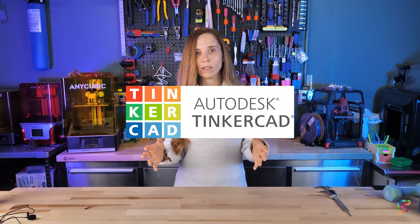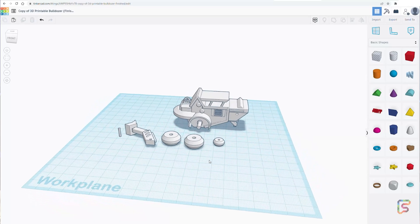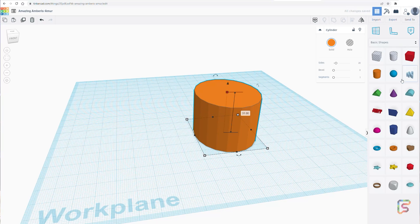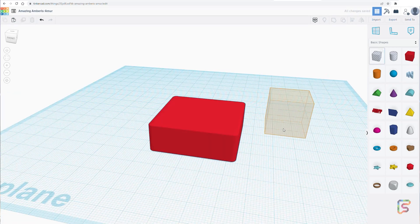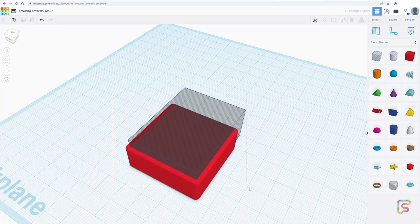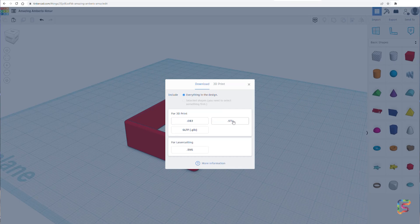Tinkercad is a product that's free, it's online, anyone can use it — even children can design in it. My son really understands it and he was 10 when he first started using it. It's all based on manipulating shapes and there's a whole library of shapes you can use to design models, and you can design fairly complicated models in there. In this case I started with a model called a rectangular prism, edited the dimensions to fit what I had here, rounded the edges off for comfort's sake, and then made a second object. Instead of being solid, it was a hole object, so when I combined the bigger and the slightly smaller shape together, I now had a C-shaped object that I could print and hook onto the table. I exported it to an STL file, loaded it up in the slicer, and sent it to the 3D printer.